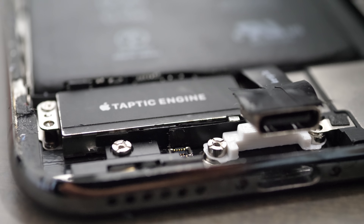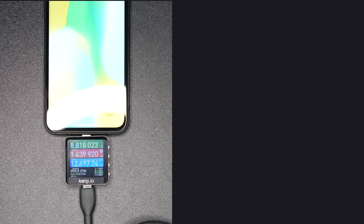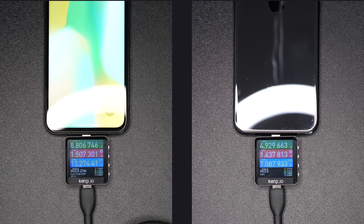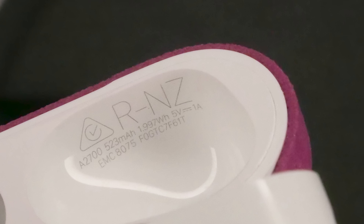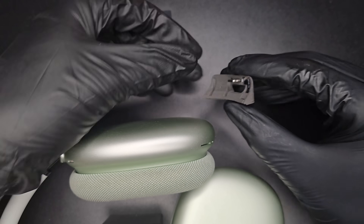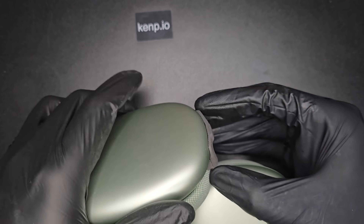When I came up with my original hack in 2021, it wasn't perfect. Basically, if you plug the cable in one way, the fast charging signals could pass through. But if you flip the cable over, it will force the phone to charge at 5 volts. Since the AirPods are designed by Apple to only use 5 volts anyway, it wasn't an issue, and I was able to produce all those adapters for them. But for the iPhone, we need to fix that.